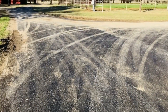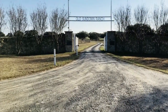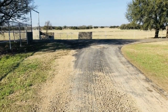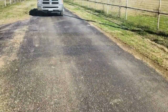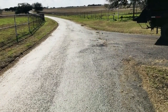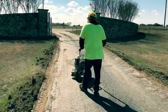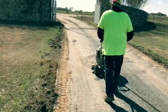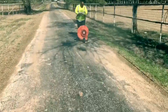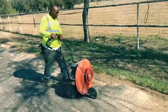How we go about starting a project like this is once we get our equipment all parked and situated, we evaluate the type of dirt and cleaning that needs to happen to the road. We chop back any grass or weeds that's growing up through the edges. Then we do any chopping and spraying of herbicide on top of it, and we send our blower guys in there, and they're going to blow any loose debris or settlements on the pavement off and get it as clean as possible so we can do whatever patchwork we've got to do.